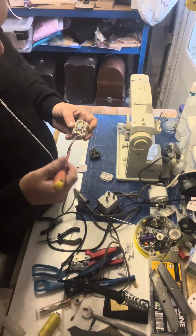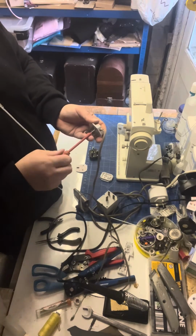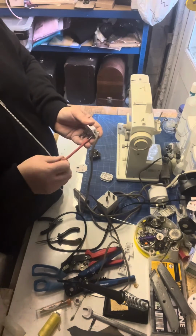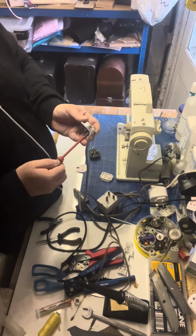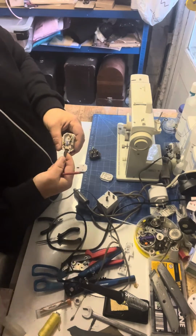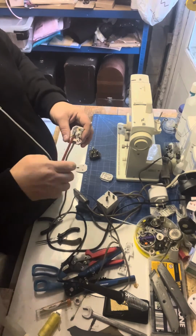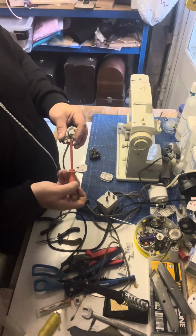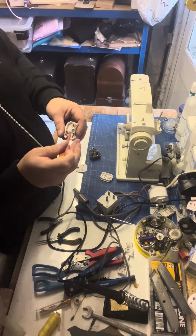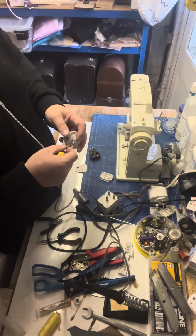If you were to pull on this plug, obviously you have this sort of keep holding it in place, but if you were to pull on the plug, the live wire is the shortest wire when wiring a plug. So if anything comes undone, the first thing that comes out is the live. Whoever put this plug in has made these the same length. But you should have the live come out, then the neutral, and lastly, if you've got an earth, the earth will detach. So it's always earth bonded.